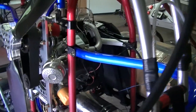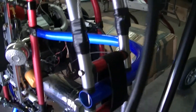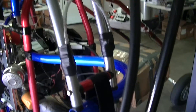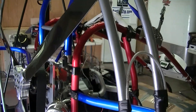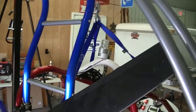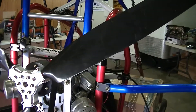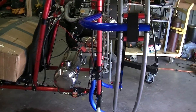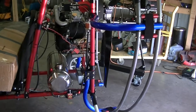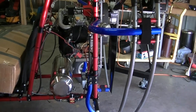I do have my wing in the box and my battery. Some people say the FAA doesn't care about the battery — I think they do. I've got my wing and I've emptied the gas tank. So it's the weight of the Green Eagle that includes your wing in order to make sure that you're underweight. You want to lift it up slow, make sure it's not hitting any of the rigging or your lights. Once you get it off the ground, you only need to take it a couple inches up. This first weight is the weight of your bird and your wing with an empty gas tank. Once you do that, you can add two gallons of gas and get that weight, then add five gallons of gas and get that weight — so you know your dry weight, two-gallon weight, and five-gallon weight.